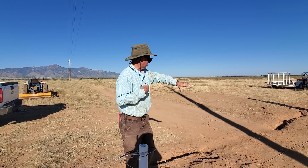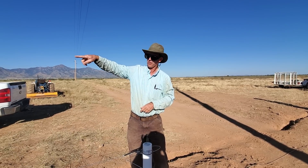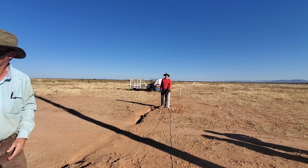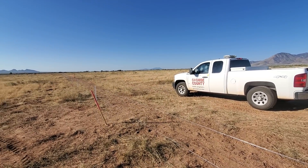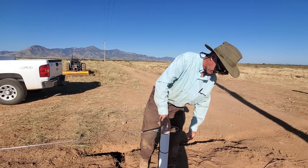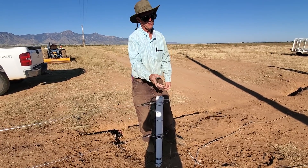We've run about 4,000 feet in this direction of Timeless fence, with Thomas fence posts on 25-foot centers, terminated on our fiberglass corner post. This corner post is in the ground 40 inches, and we actually took an auger and dug a hole — you couldn't drive them out here, the ground is just too hard.